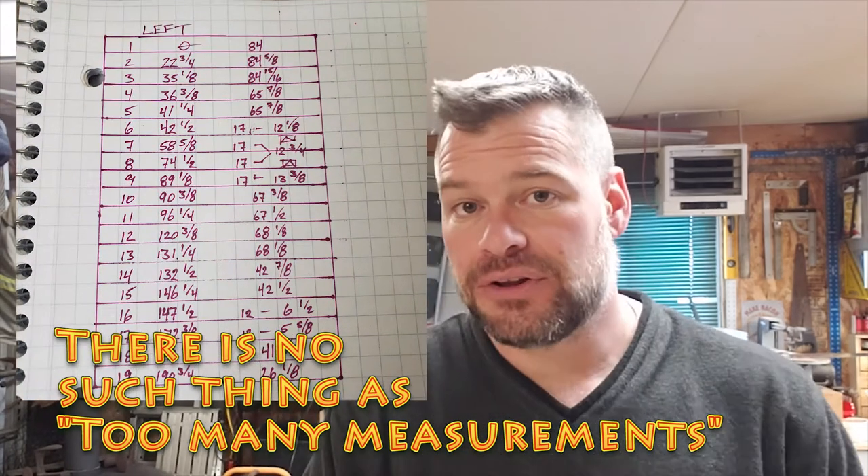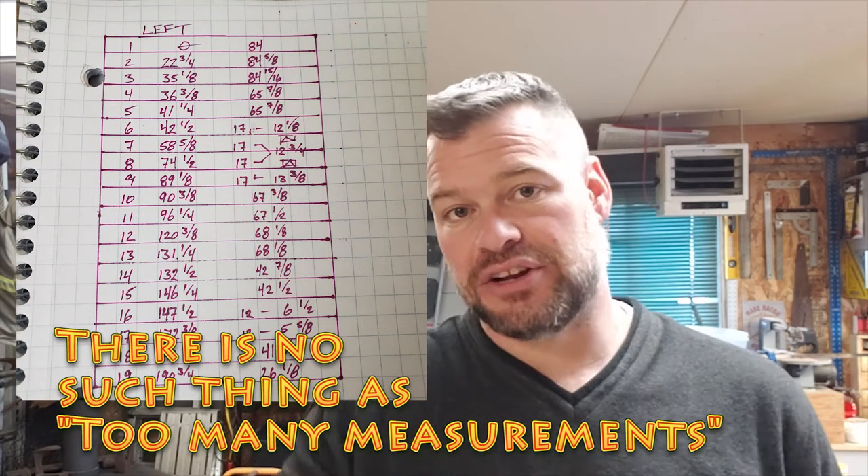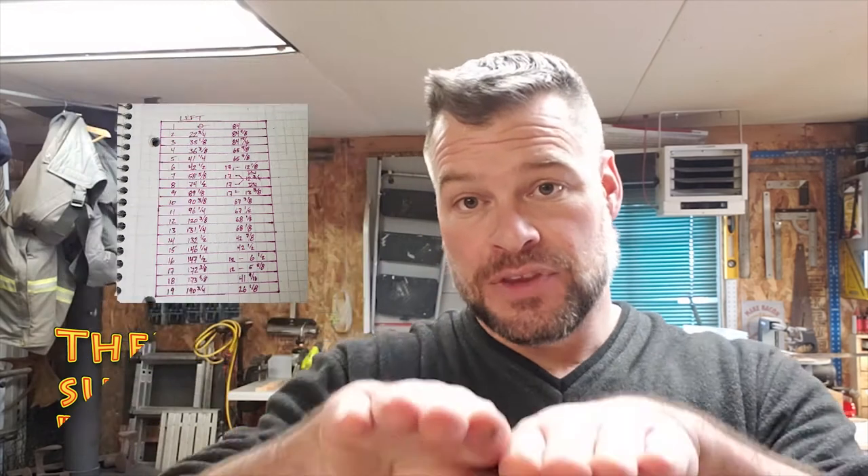So I've got a lot in the wall that are free-spinning, meaning the sealant is essentially the only thing keeping the plywood there in those areas. There were a couple of places where I was at 46 inches, so I trimmed off the 48-inch wide material to line up halfway on the stud, rather than add another stud or have one sheet edge flopping. I broke it down to six sheets going across. After I had five of them from back to front, that's probably 300 screws and two tubes of sealant.